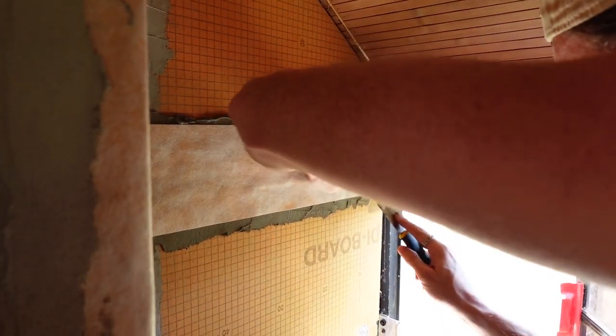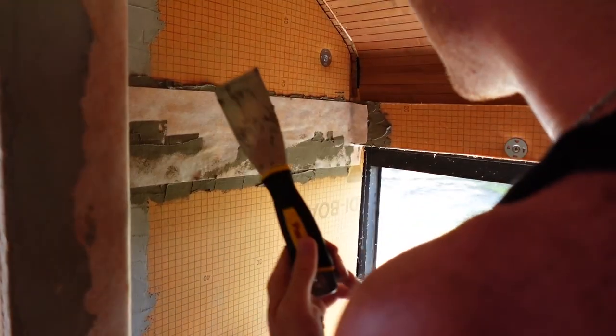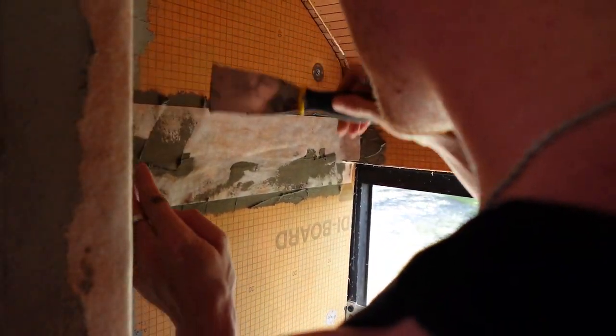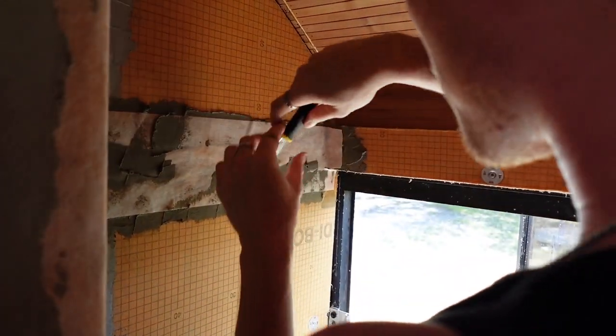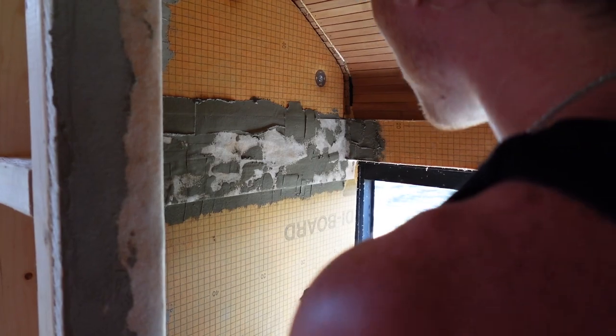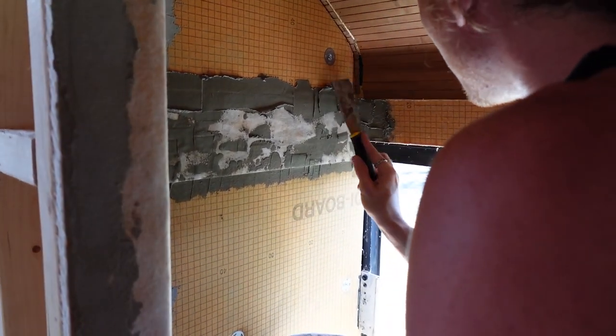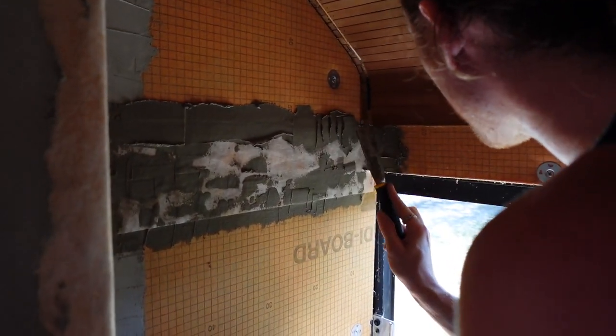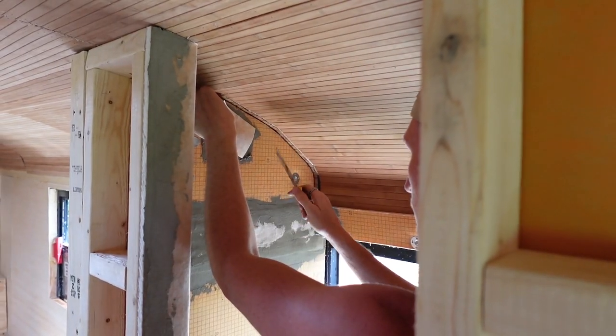And after you lay it on there, you just kind of want to firmly start pressing this out. And it helps if you have a 4-inch scraper. Do the whole thing at once rather than this, which is a lot more tedious, but still works. So I'm being a little bit extra precautious and I'm going back and buttering over the seams here because that's gonna prevent water from penetrating back behind that. Now it's on to all the screws.